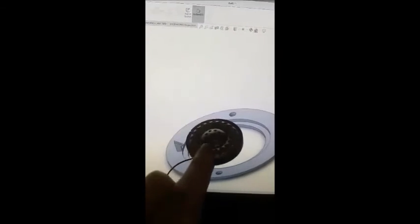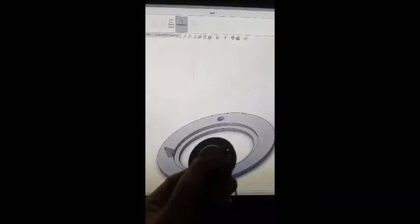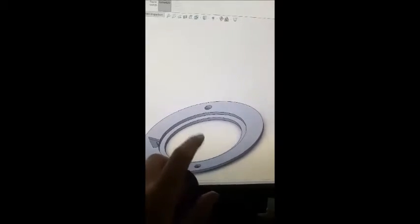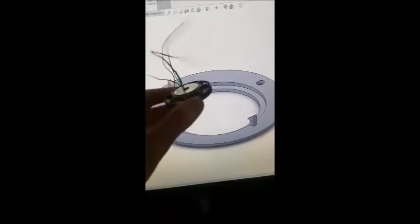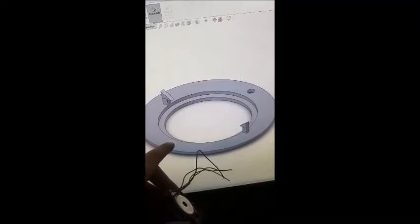There's no way this driver is going to fit in that little adapter or even the frame, so I'm just going to have to make my own. It's 3D design time. It's supposed to sit in there that way, and those little things will be plastic clips to hold it firmly inside. With the screw holes I can fasten it tightly in there. This flips over, clips in with the clips, and then screws down into position - held up by the lower lip, held down by the clips, and fastened into place.